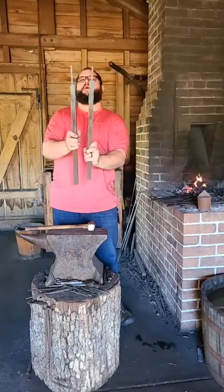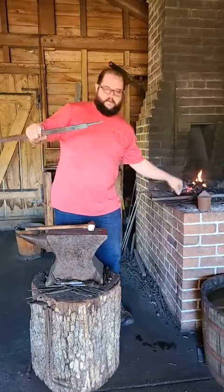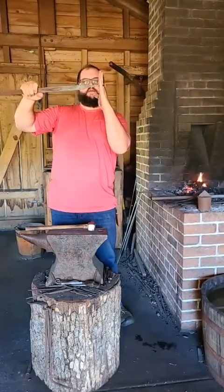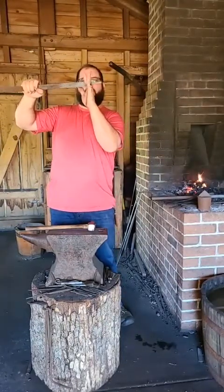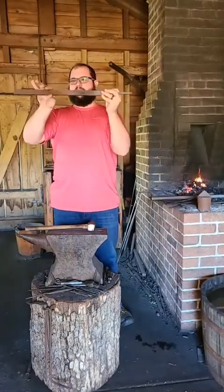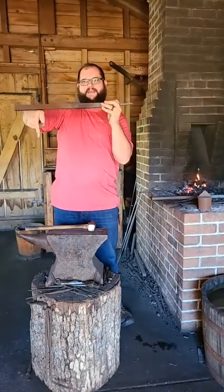He'll be probably stretching that out just a little bit at his home forge, and then we'll come and punch a hole. These are way too long — they're not meant to be uniform. We'll cut them off to fit. What I'll do is take the other pieces you saw in our last video, scoop right up next to them, cut off the excess, wrap it around, and then decide how tall we need this leg to be. We'll bend that foot back down.